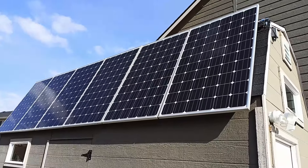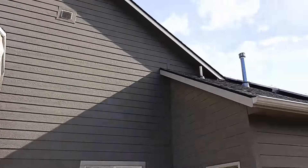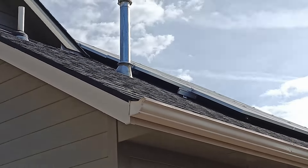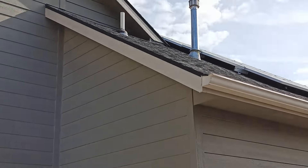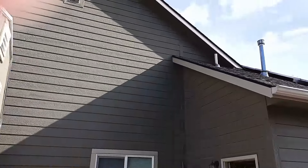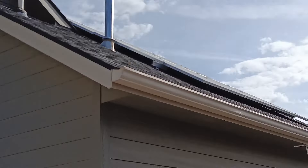Those optimizers behind the modules all require a wireless TAP unit, which I have mounted underneath that panel here. They're good for a distance of — I want to say it was 33 meters or so — and they broadcast far enough that the optimizers over here receive it, which is only around 30 feet. But 33 meters is far enough that they all receive the wireless signal.